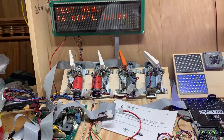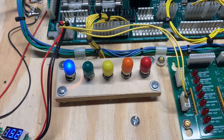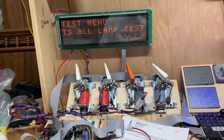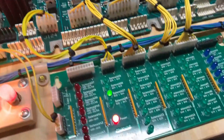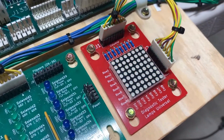Let's do general illumination — always important — because sometimes when folks are hacking about on the bridge rectifiers, they sever the traces that go to the zero cross circuit and your general illumination will not dim. Now I'm going to do lamps and flashers all at the same time. Those are all the flasher circuits, and those are all the lamp drives. Looking good.